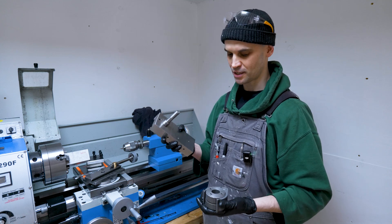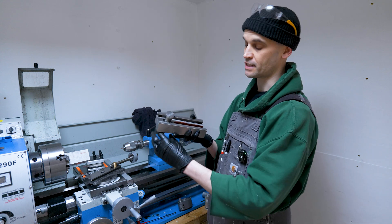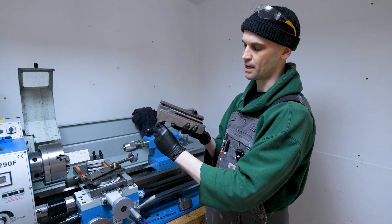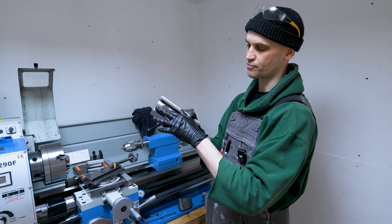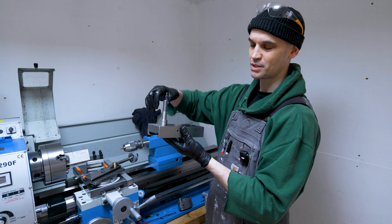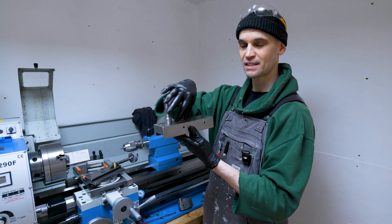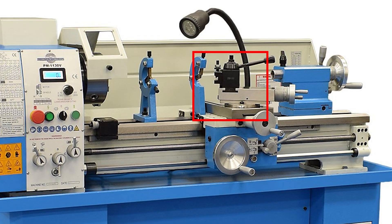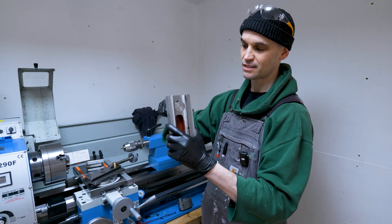In case I make mistakes, it's going to be much easier to get it right. Now you can see the way this stud fixes into the compound — we have a bottom flange here of 35mm that registers, and there is a set screw that will stop it from twisting and turning. I know a lot of the American versions of this lathe have a T-slot, but it seems like the ones in the UK just have this through-stud with flange setup.